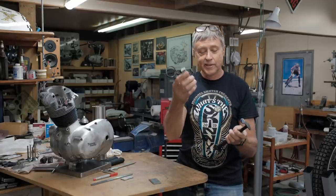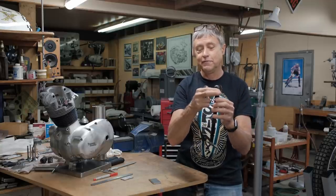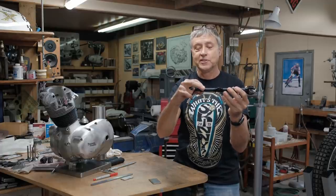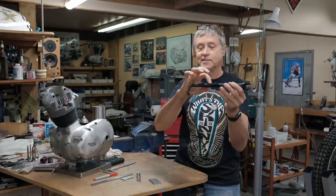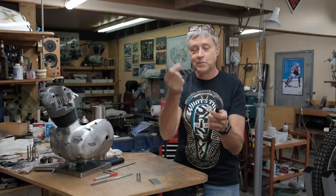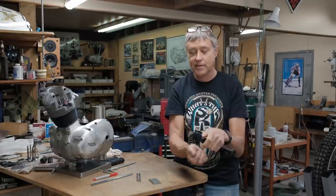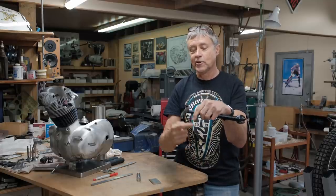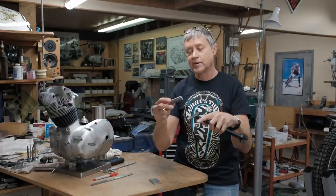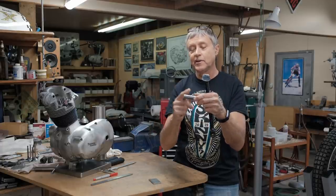This is going to go in the lathe. I found out that this fits in my spindle hole, so I can hold this in my chuck. Because this is a taper, I got 3 pieces of aluminum, and they're going to go around like that. So it'll get hacksawed off, it'll get faced and drilled out, and then we're going to make an insert that gets TIG welded into that. It'll be cut off to the right length.